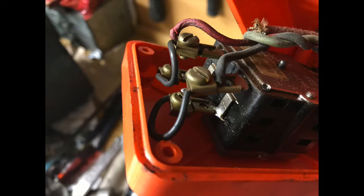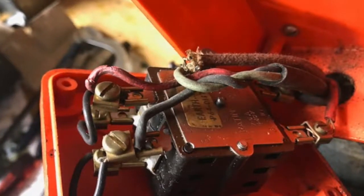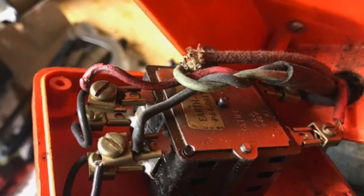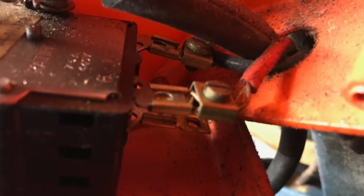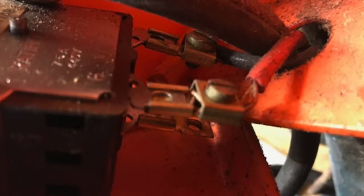The original wiring had the two linked together with two black jumper cables, but these will have to be removed. Entering this orange box are the three wires from the three pin plug which connect to the upper layer, and there are also two wires that go down to the main windings on the motor, which are separate from the reversing windings I'll be talking about in a minute.